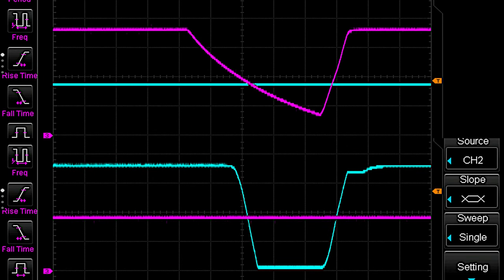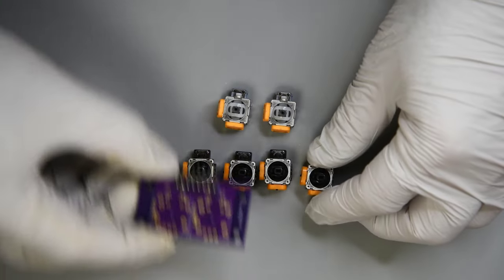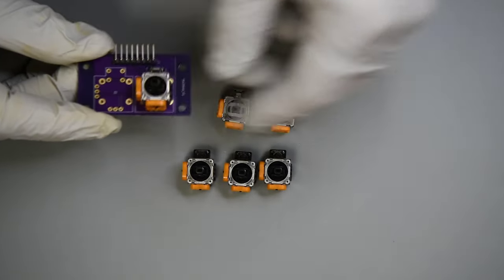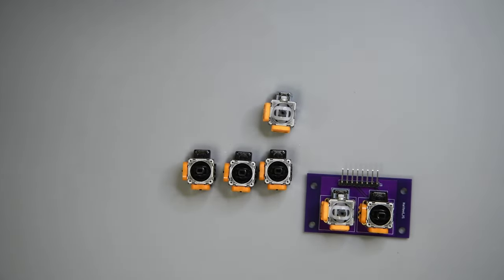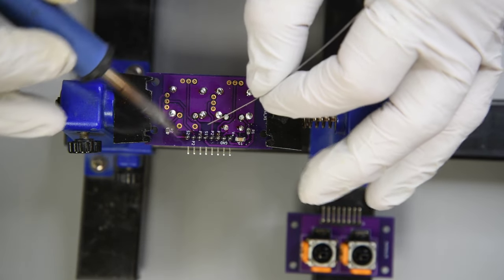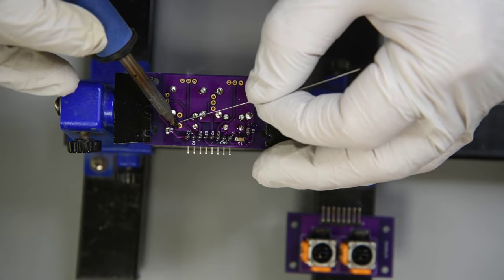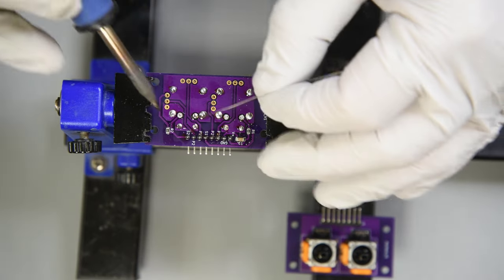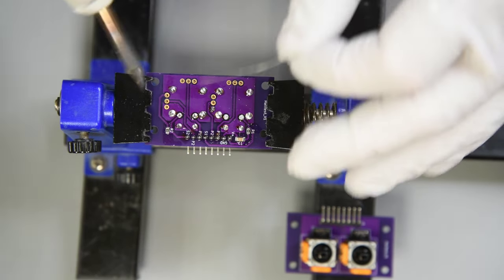Looking at the waveforms, I'm surprised they work at all. But the controller I grabbed first is the one with the Hall sensor joystick, and it does feel smoother playing. The goal for a Hall sensor replacement joystick should be to reproduce the potentiometer output as closely as possible — and the asymmetric slope output these Hall sensors have is quite strange. A casual gamer like me might enjoy the feel, but a competitive gamer might have a problem with it. In the DualSense controller, it means moving up and left have a slightly slower response than moving down and right. But on the upside — no more drifting problems. Thank you for watching.